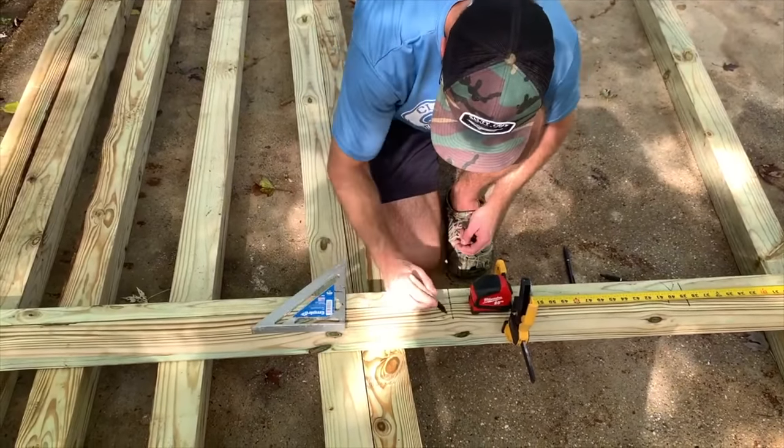Here's what I mean by that. So even though I have the luxury of a helper, installing that temporary support bracket on the outermost roof rafter is still helpful when you're doing the installation of the fascia board. As you can see, we're checking right there to make sure that we have the 1 foot mark positioned on the outermost edge of that fascia board. And then I'm taking a drill with some 3-inch screws and securing the fascia board, making sure it's crown up, into the outside of the roof rafters. As you can see, I'm making sure it's flush there, and I'm gonna go ahead and install.